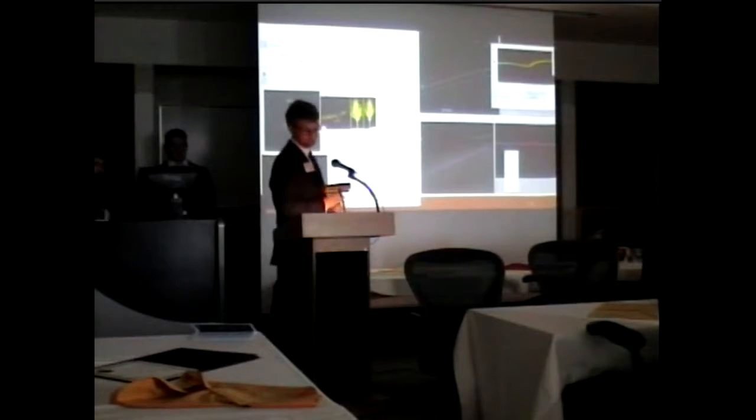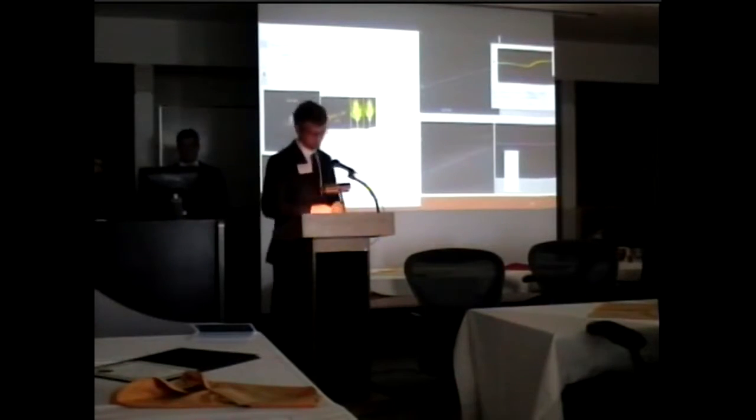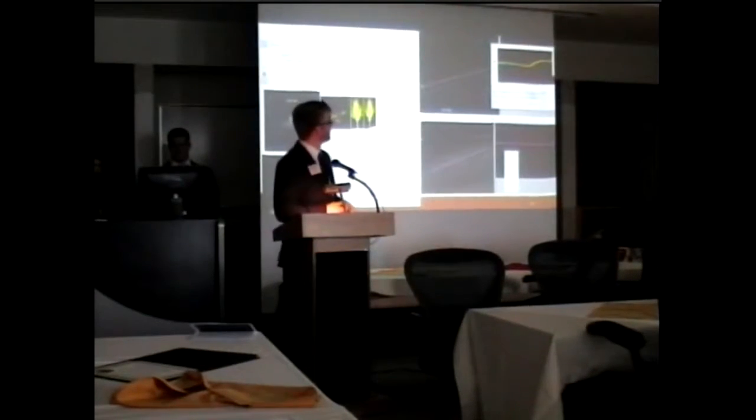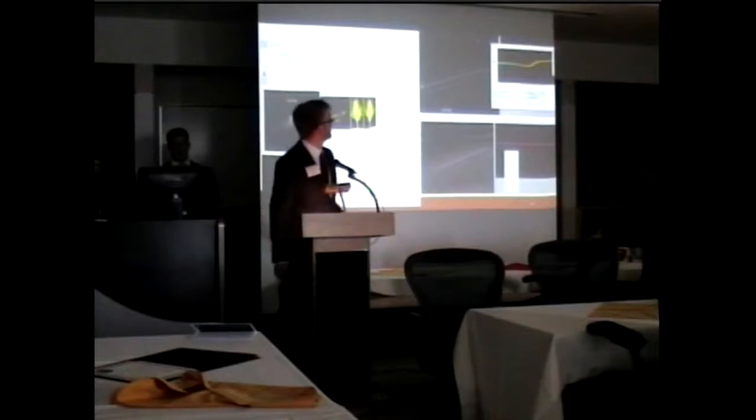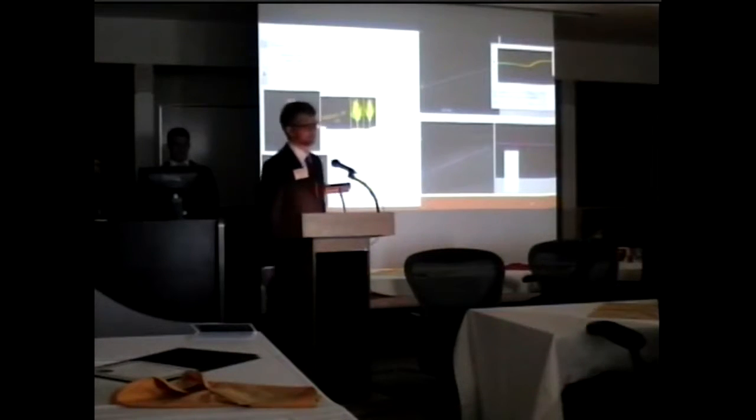The most popular tool we used was called the break line extraction tool, which is at the top right there. How that works is you just draw a line, and then you open up the tool, and then you're able to pick really anything you want. We did edge of bit or edge of pavement, and then that gutter pan or flow line, and then the top of curb, which is pretty easy to see as long as you have a nice clean curb layout.